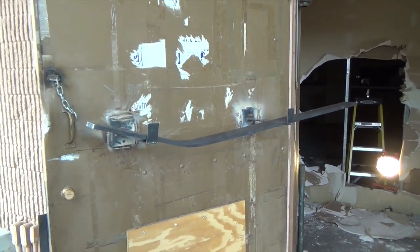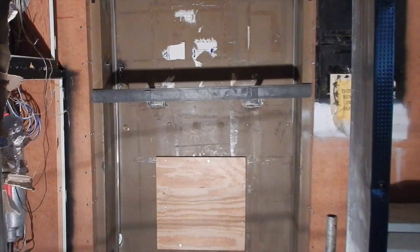Obviously, looking at this door compared to the other ones, it doesn't have any bolt patterns on the outside of it. And that's because the drop arm mounts are welded on all four sides of the mounts on the interior here, which you can see. With that said, we don't have those other options that we normally would, like driving bolts through the door or cutting the bolts with a saw and releasing them from the system. So it becomes real important that we're capturing our progress and that we're getting the leverage right where we want it, because we don't have those options to fall back on.